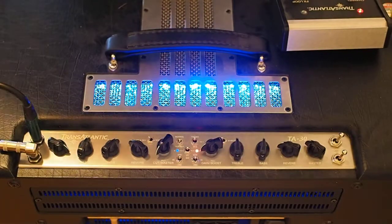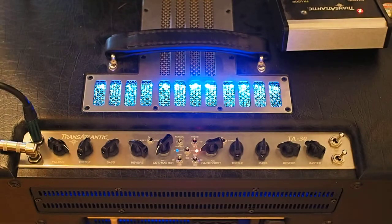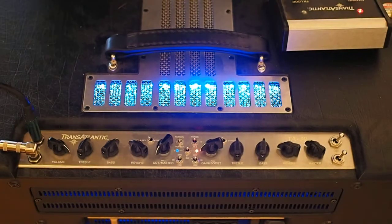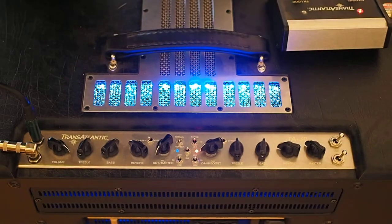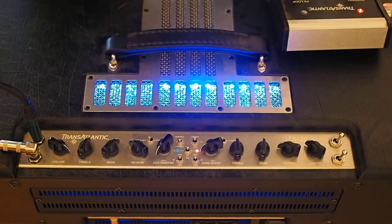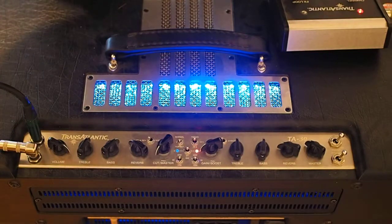So if anyone's got some suggestions, I'd appreciate the help. I've gone through the systematic tube replacement procedure — buying a brand new preamp tube and replacing it systematically one at a time through each of the preamp tube positions. I also purchased a new pair of power amp tubes and replaced them systematically one pair at a time. It doesn't seem to be a tube issue; there was no change in behaviour changing tubes. If anyone's got any suggestions, I'd appreciate it. Thanks very much.